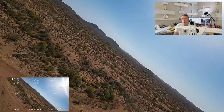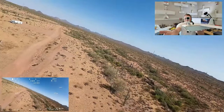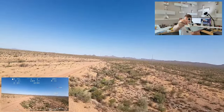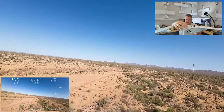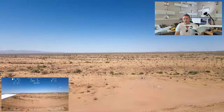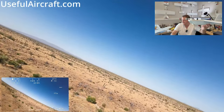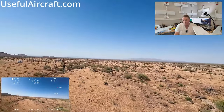My pan-tilt is a homegrown pan-tilt assembly. There's one servo mounted inside and a second servo up here which controls the camera pitch. The upside of this pan-tilt assembly is that when facing forward, I'm able to pitch the camera all the way down, and with the geometry of how I've worked this out, you'll have no portion of the aircraft in sight. You can get a really nice orthographic — basically a top-down — view of whatever it is you're flying over.